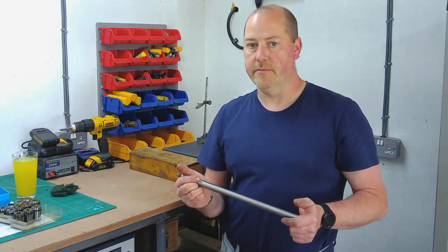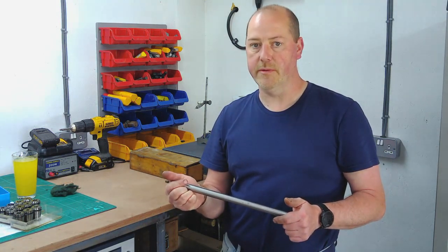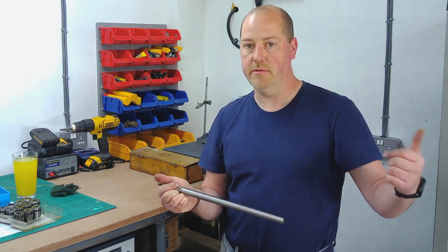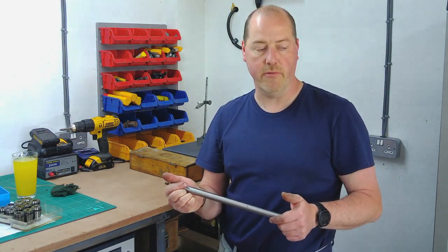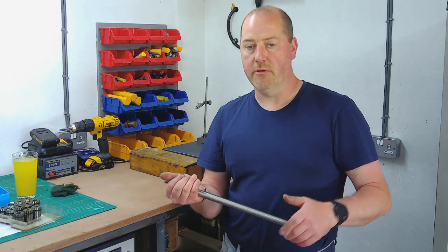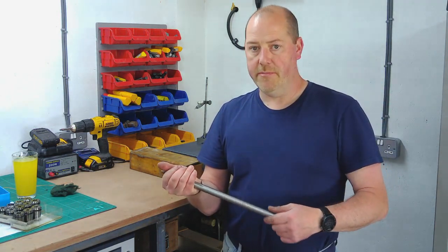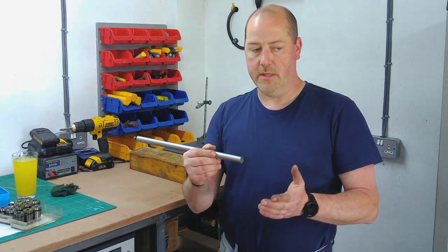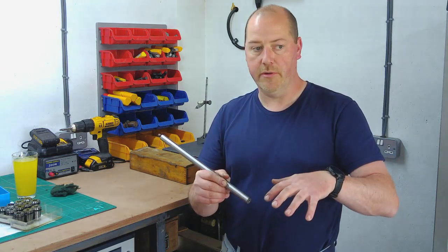They're much better than parting off at the front, for many reasons, but not only the fact you don't have to keep changing the tools at the front, you can always have it set at the back if you've got room, but secondly, and I'll do a bit of a whiteboard demonstration of this, with a rear parting off tool, the whole lathe works on the principle of gravity holding the saddle down on the bed.